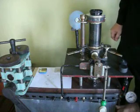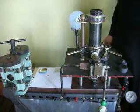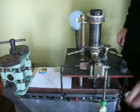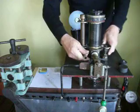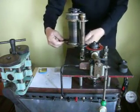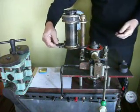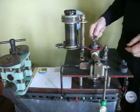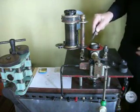Now it looks as though Stasha's ready to open the furnace and take off the first casting. Unlike the lost wax process, there are no plasters, wax injectors, rubber molds, vulcanizers, or frames. And unlike rubber molds, graphite molds will not warp or age and are virtually indestructible. There's no long, expensive, dangerous burnout time, no smelly wax fumes or chemical sprays or any waste at all. And best of all, there's no metal loss.